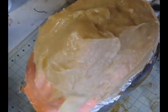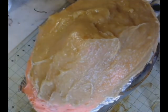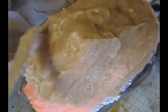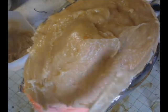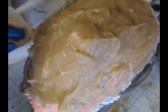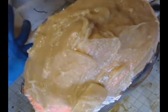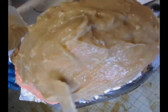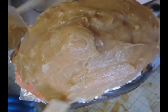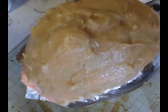And that's the thing about Plasti-Paste. You need it to be thick. You need your mother mold to be thick, and you need it to be durable. The only way to do that properly is to have enough of the Plasti-Paste material. So don't scrimp on it, because you'll kick yourself if you break your mold before you get full usage out of it. If you're doing this to mass produce props, every bit of money that you pour into making a good solid mold is just a return on your investment down the road. That's probably the most expensive part of mass production, making your molds. So you want to use those molds as long as possible, because if you don't, you're going to find out that's a huge expense.